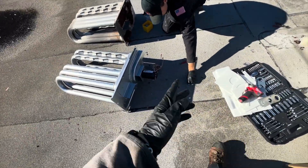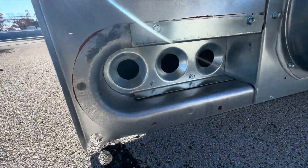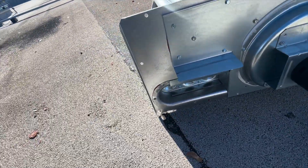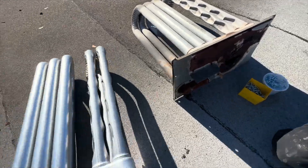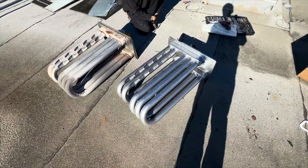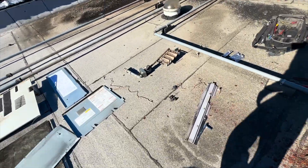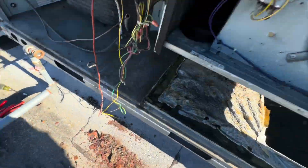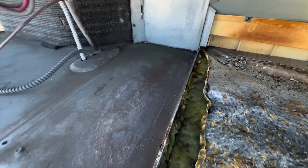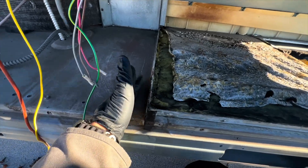They gave us a boatload of gaskets, but the parts themselves also came with the same gaskets. It looks like we got everything assembled the way it needs to go — the burner plate is right there, the inducer motor's on, this plate is on, and everything looks identical to the old one. So I think we are ready to slide this in. I think we'll put the burner in afterwards since everything looks accessible after the fact, so we'll get it into place. I cleaned out all the debris from inside the unit so we can have everything properly installed.